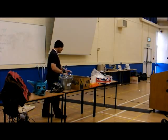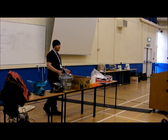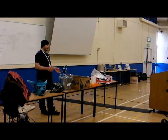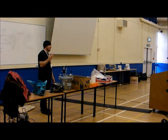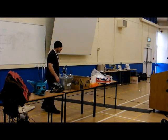That's the other thing with clear resin. Even if you are going to do it and you don't mind the bubbles, clear resin cures in a few hours. Clear resin fully cures in about 5 days. If you pull clear resin from a mould too early, it will be gummy and sticky. And you will put fingerprints in it and blah. That's why that test dye is actually a bit crappy on the surface.